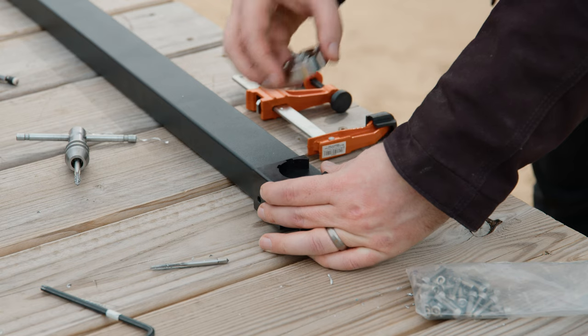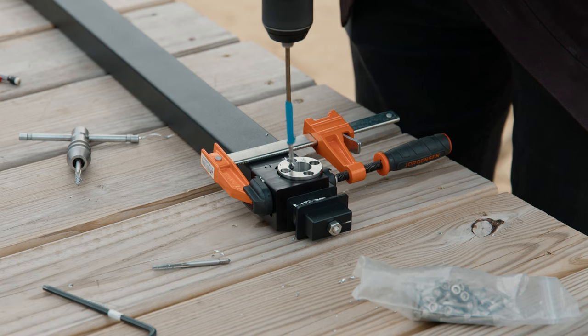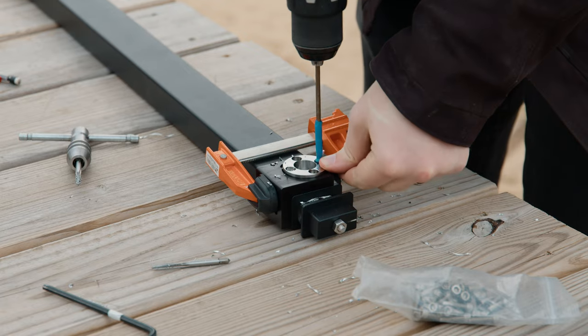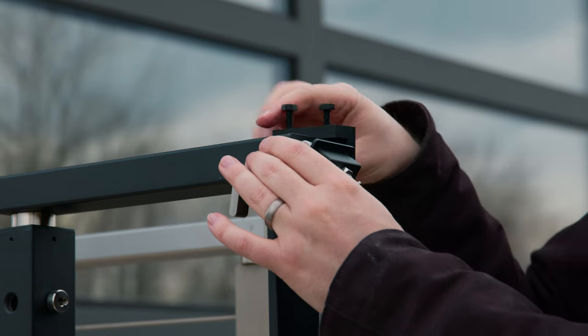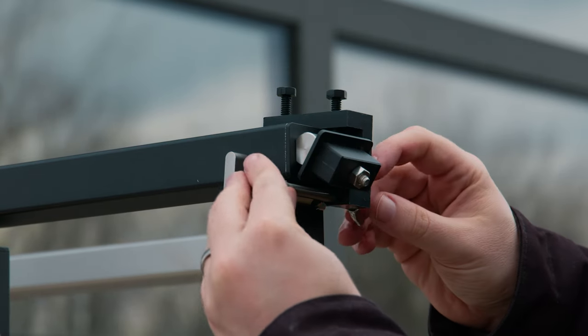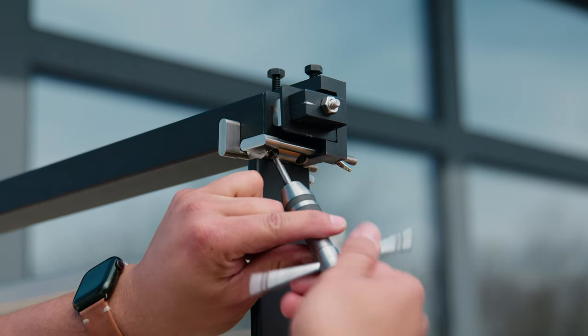Now we're ready to attach our post top. If we're on any sort of tensioning post with a 2x2 inch column, we'd use our handrail drill guide and template aligned with the cut of the handrail, positioning the collar so that the screws are in a diamond formation. We'll only end up drilling and securing three screws since the fourth would partially overlap the set screw we secured earlier. We'll drill our three pilot holes through the wall of the handrail and into the plug of part A of the hinge. For a line post, we would secure the top in place with our handrail clamp for line posts, setting it using one foot on the handrail and the other on the post top. We'll drill our two pilot holes, tap them with a 10-24 tap, and secure the post top with our two 3/4 inch screws.